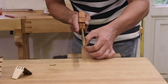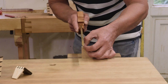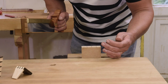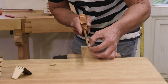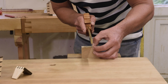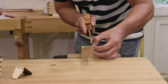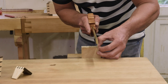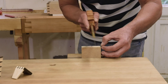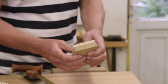I would suggest keeping things vertical in the vise, as vertical is the easiest way to cut. Just pinch your thumb against the blade, start at the back corner, and make a notch. I'm not attempting to follow the dovetail angle at this stage — just controlling the saw with the thumbnail.